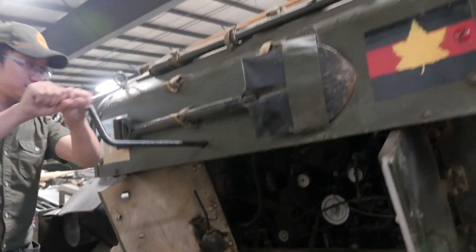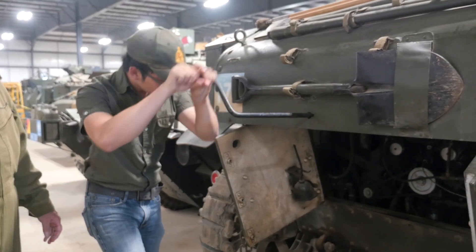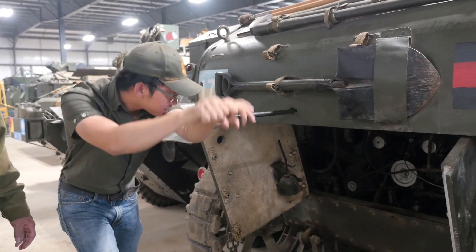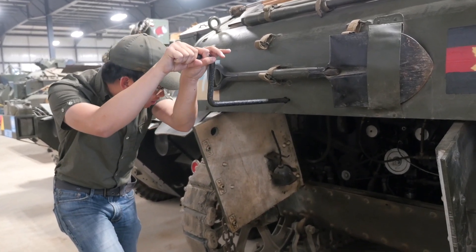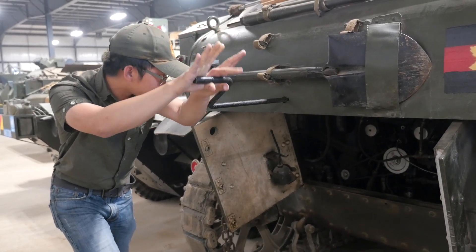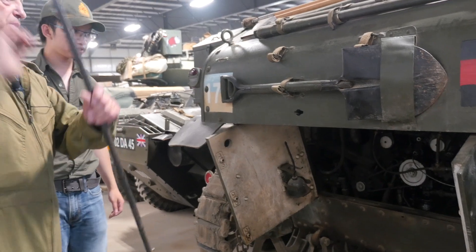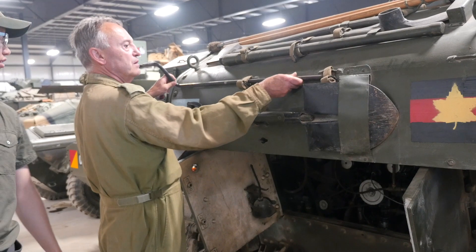So you've got to put your back into it. Step your left foot back, your right foot forward. So once you get the numbers on to the bottom of that pulley facing downward, now you find a tough spot where it's easy to turn — you'll come to a spot where it's stiff. As soon as you feel it, that's good. And what that does is sets the engine up for combustion. So now we're ready to go into the vehicle.